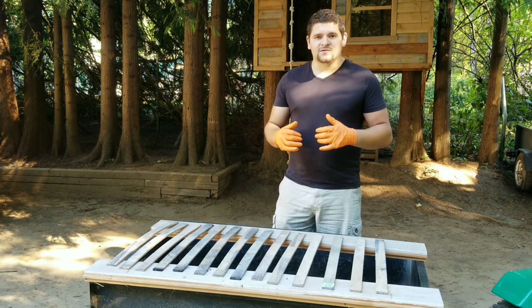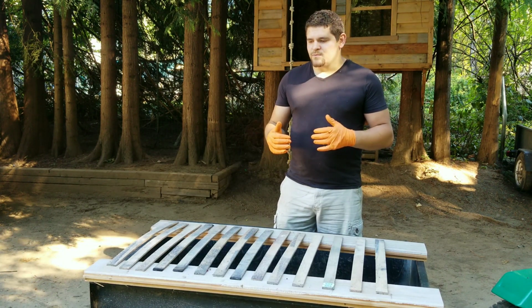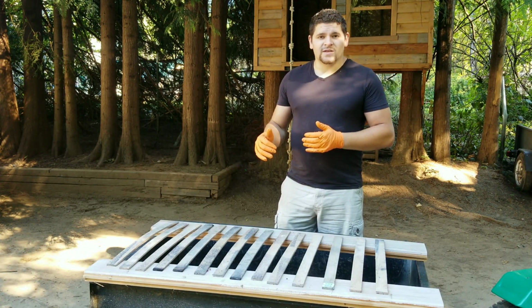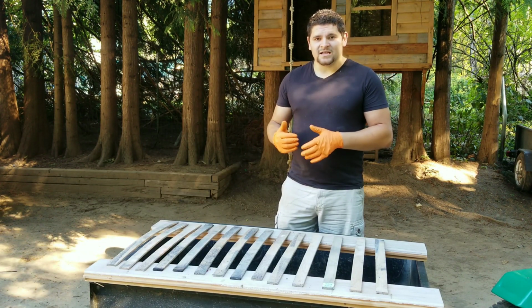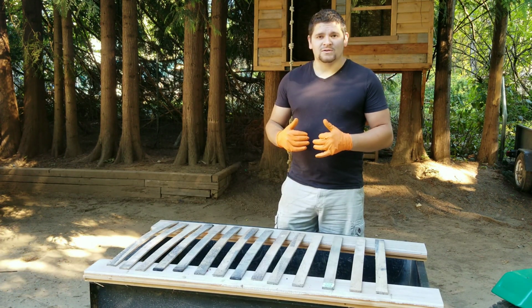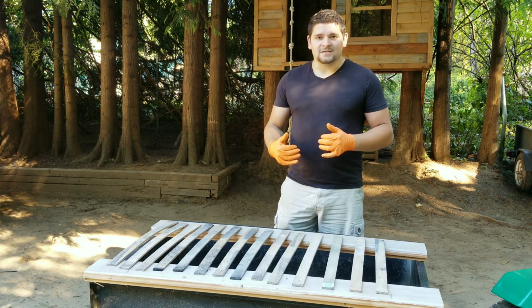I'll sand the varnish a few times and then recoat it, and then at the end of it we may even hit it with a 2000 and hit it with an automotive clear so it gets that UV protection. Otherwise we'll just polish it out with 2000 and it's gonna look nice and glossy.